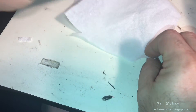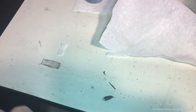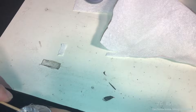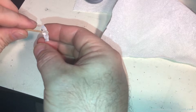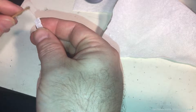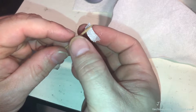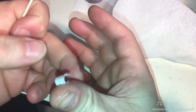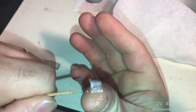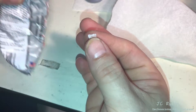I've got some paper towel here. I've peeled it back to a single ply and cut out a small test piece. I'm going to be using some E6000 glue — it's not going to harden when it dries, it's sort of rubberized. I'm going to take some of that glue and evenly coat this piece of paper towel. I want to work it into the paper towel — it should become clear when I do that. Not so hard that I rip it though. Just sort of press it, use the toothpick to hold it in place.